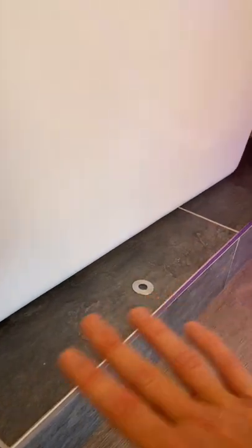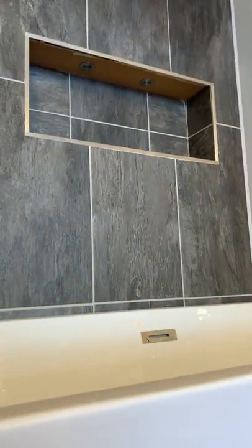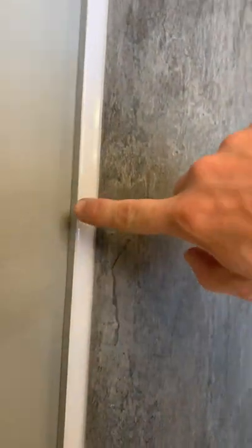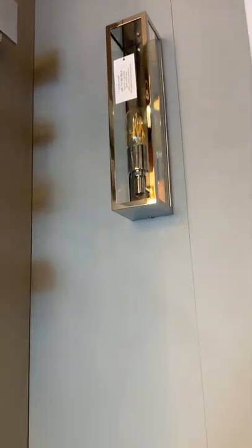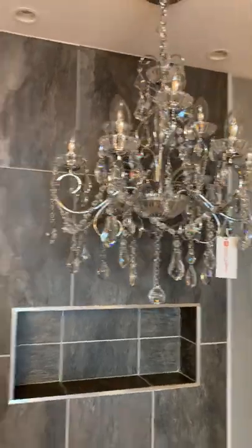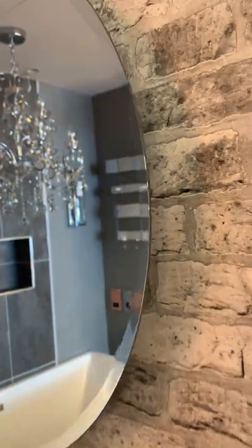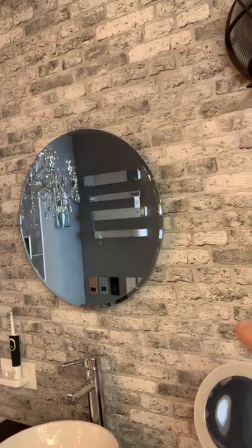These are little LED walkover lights sat around the bath — if you're sat in the bath relaxing, this is what you'd have on, rather than putting candles on the floor. Then we've got this inset shelf with two lights — that's another circuit, so we're up to two already. In the wall there's a profile; a lot of people will tile and then paint the wall up to it, and there's an LED tape in here — that's three circuits. We've got these beautiful modern wall lights with warm white lamps — another circuit. A crystal chandelier — one of these over a bath would look stunning. We've got baffled downlighters in the wall. And we've hidden an LED tape around the perimeter of this mirror to create an eclipse effect — it sits behind the lip of the glass so you only get a silhouette of light come around the sides — another circuit.